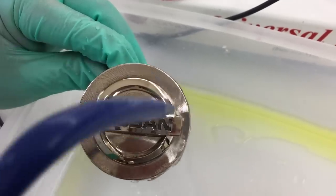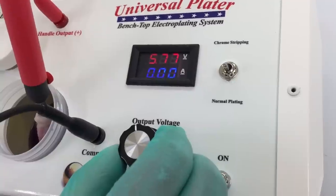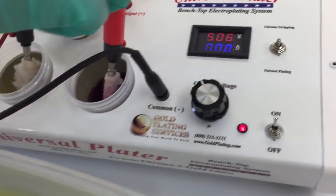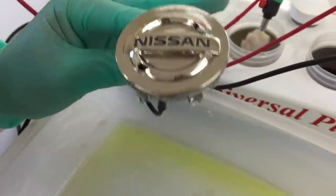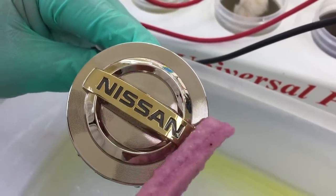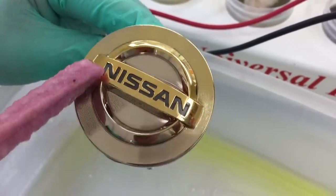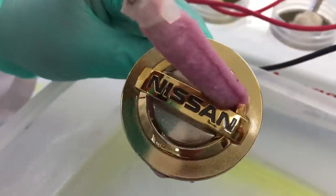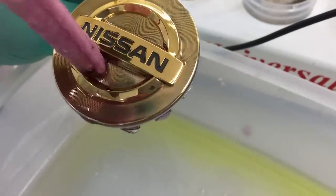It's really important that you change the voltage between this step and the next. You don't want to be gold plating at 6.2 volts. You want to change it down to 5 — I would recommend 5 at the most. Stay at 5 because the voltage is going to drop down as soon as I touch this to it and start plating. It will drop down by about a whole volt and go to 4 volts. You know immediately the gold starts to fly on there — that is a good sign. If it's taking 5 to 10 seconds for the gold to start going on, there's something wrong. Maybe you didn't strip all the chrome; that's most likely what happened. Or your voltage is too low. But if you've got to turn it up much more than 5 to 5.5 volts, you probably have a chrome issue.